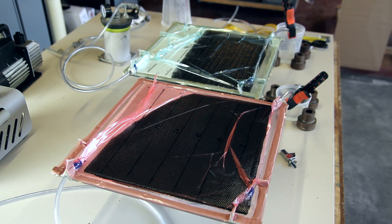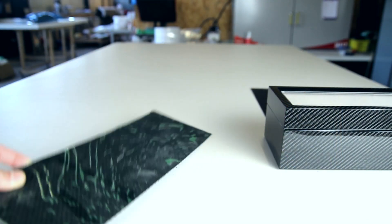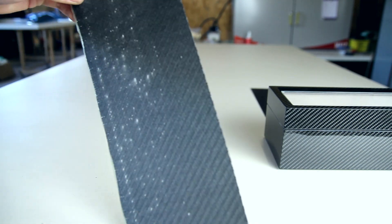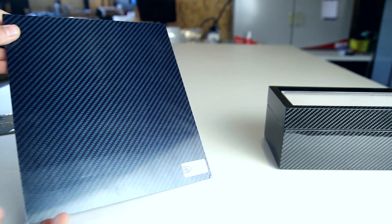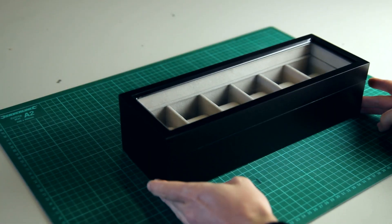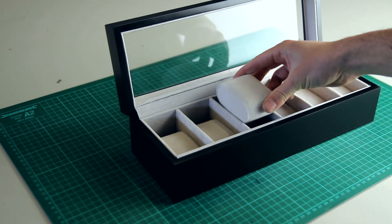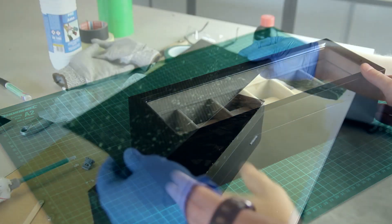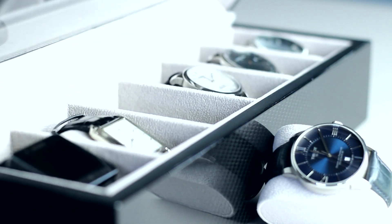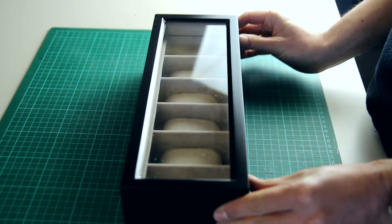For this tutorial we'll be using the two plates that I've made in the previous tutorial. If you want to know how these were made, you can check the link down below in the description. Here are the plates — it's a 6k, 240 gram per square meter, two layers with a peel ply finish. The cool thing about this tutorial is that if you cannot make carbon fiber plates or have no experience with carbon fiber but know a bit about veneering, you could do this on a pretty low budget. We won't be making expensive molds — just adding plates cut to size onto this watch case. I bought this watch case on Amazon for about 25 euros, and we'll be using the sheets of carbon fiber to veneer the entire box, just to skin it with an outside layer of carbon fiber.